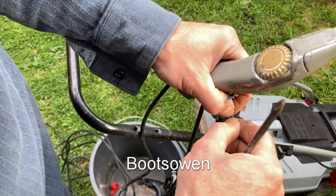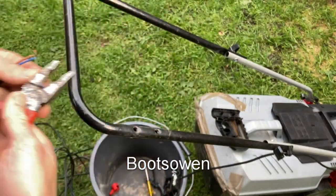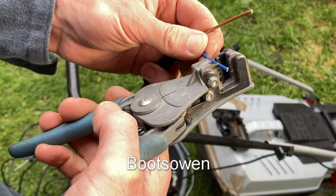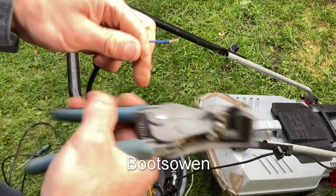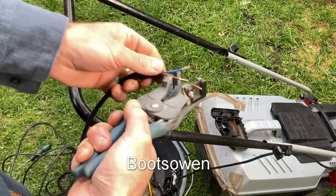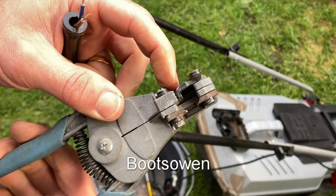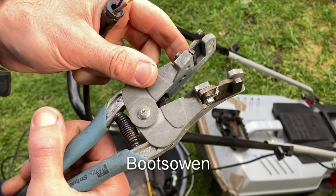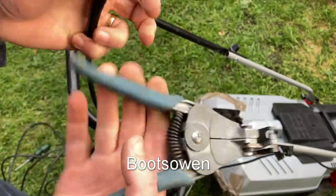Cut them off about here. Wire cutters on a pliers would do this, but a scissors would equally do it. This thing is a wire stripper — you could just use a penknife or a Stanley knife. That makes the job a little bit quicker if you're doing lots of them and saves the fingers. It has this nice action where you pull the handle, it clamps the wire, then it grips it and cuts it, and then it pulls it apart, and it releases this side first and then that side, and then snaps back together.